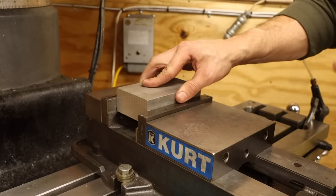A freshly fly-cut face never gets old. After cutting the other side down to thickness and fly cutting the remaining four faces square into dimension, I'm ready to move on to the other features. First is a long bore for the bushings — I'll get the block set up overhanging the edge of the vise, with some material on the other side to balance out the jaws, then drill through with a slightly undersized drill. Since I don't happen to have a reamer that's the correct size, I'll use the boring head to open it up the rest of the way: a skim pass followed by a spring pass to measure the starting diameter, then a few medium passes and a finishing spring pass until it's a perfect friction fit for the bushings.